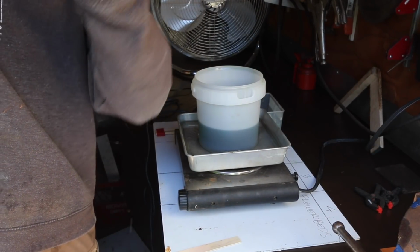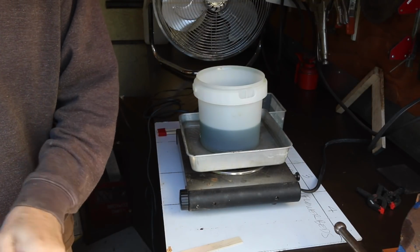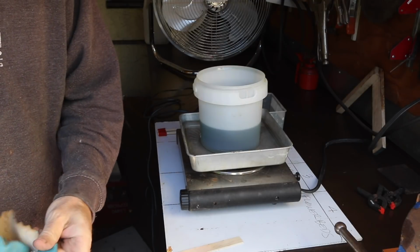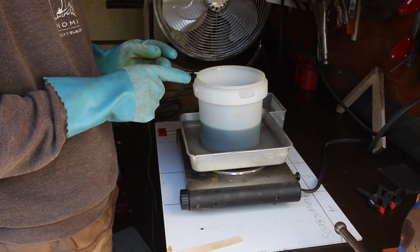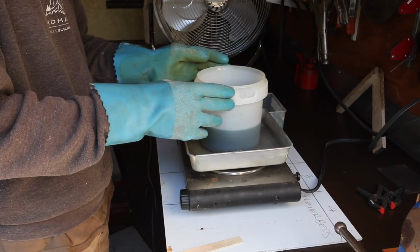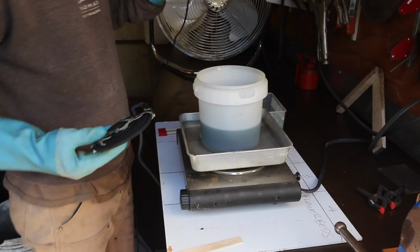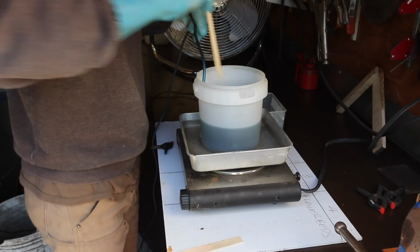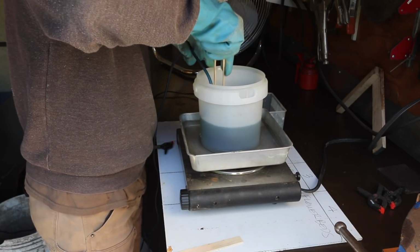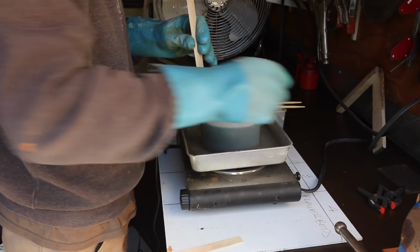Okay, whenever I'm messing around with the acid, I always put on a full face shield so my vocals might sound a bit weird. I wear heavy rubber gloves. And this acid is one part muriatic acid and two parts hydrogen peroxide. And into this we put this bubbler. So this is like a fish tank bubbler right here. And so this is just to make sure that our part is being agitated and oxygen is being introduced to the acid. So I hold this down with, stay in there.